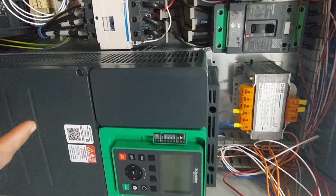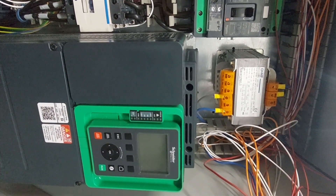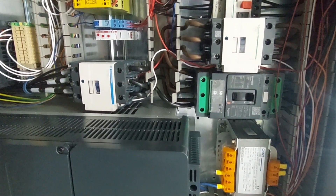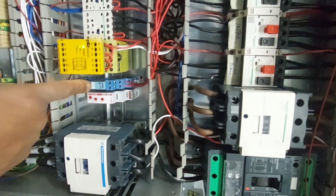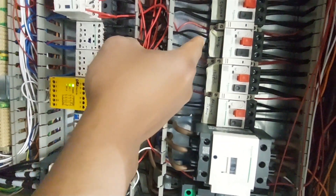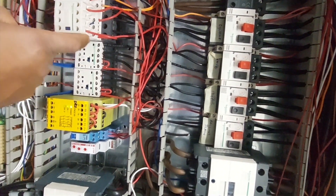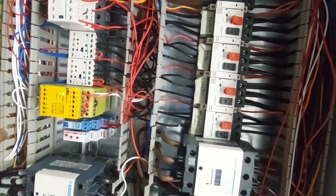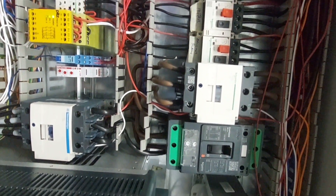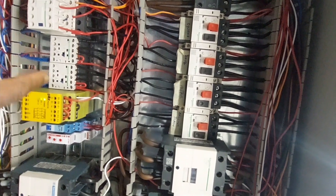When the mill reaches full speed — full speed here is 2955 RPM — it's going to trigger this relay. This relay is going to start these three machines, these three motors here. So when the speed goes down, the three motors will stop. When it's back at full speed, the three motors will come back on.